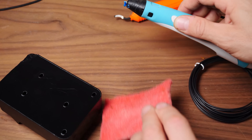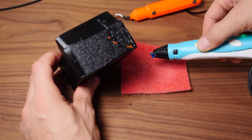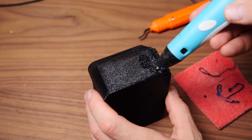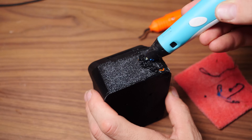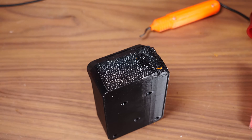Here's one that definitely isn't absolutely necessary, but it has saved me some major hassles and saved a few prints from having to be completely redone: a low-cost 3D pen. Basically a 3D pen is just an extruder with a hot end that you can hold in your hand and extrude filament wherever you might need it. I don't use this for making 3D drawings — I use it for fixing 3D prints that don't come out exactly perfectly, have holes, or something like that. They will look pretty hideous because the 3D pen is a very crude and imprecise instrument, but if the area you need to fix is hidden or it's a functional part you don't care about looking pretty, the 3D pen can save you from having to reprint it entirely.